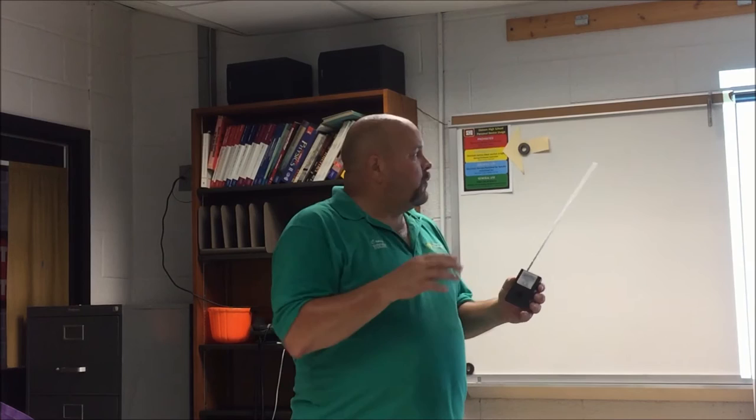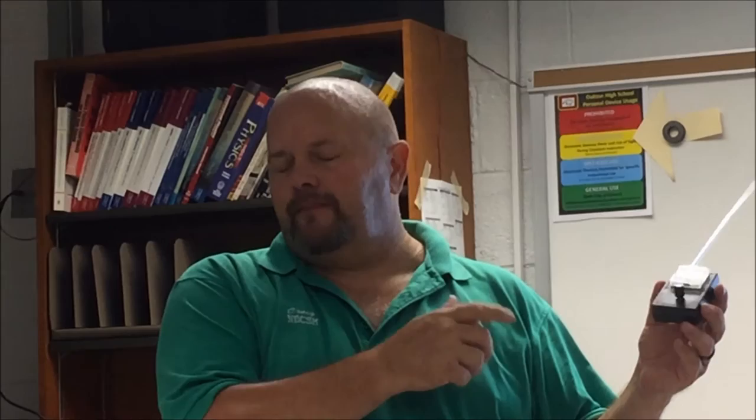But what I really wanted to find out then, okay, does this all really matter? We've heard the story from Mary Moon last year at the Marine Corps Marathon, had two Baofeng UV5Rs, one with a tiger tail that Vienna Wireless made and provided, one without. She was on the radio without the tiger tail, and she could not hit the repeater for the station she was assigned on the marathon course. Mary, pretty smart operator, reaches over, grabs the other radio, and spent the rest of the day on it because she could hit the repeater with that radio. The only difference was a tiger tail. To me, that's proof enough right there. That's your proof in the pudding.